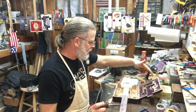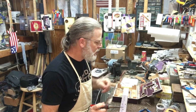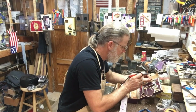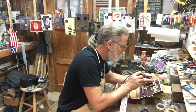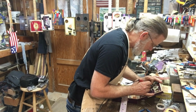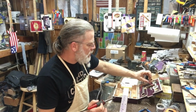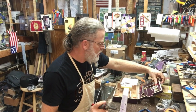The very first thing I'm going to do is I'm going to do the far away pieces first, and the connecting pieces. So the very first thing I'm going to do is connect the ground between the switch and the potentiometer. I already did that already. The second thing I'm going to do is the output of the switch to the input of the potentiometer. So if both your wire and your component are both tinned, then all you have to do is touch them together, touch the hot iron to them, and they solder together just that fast.